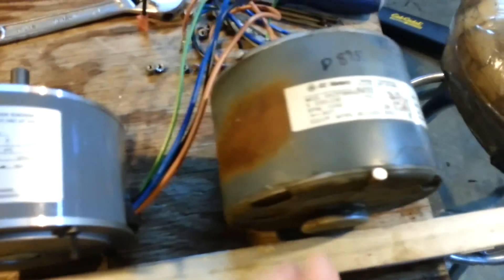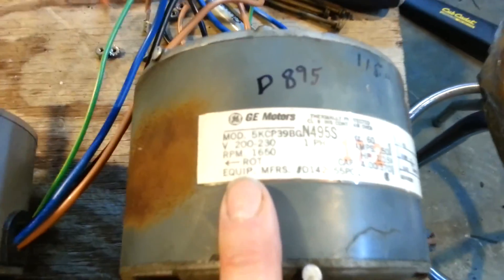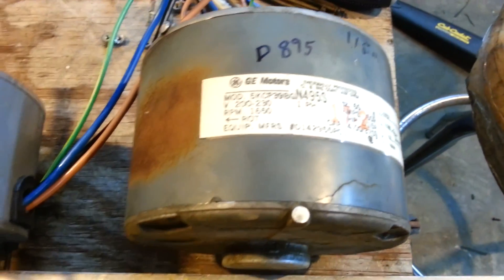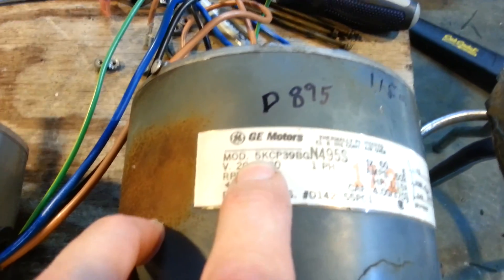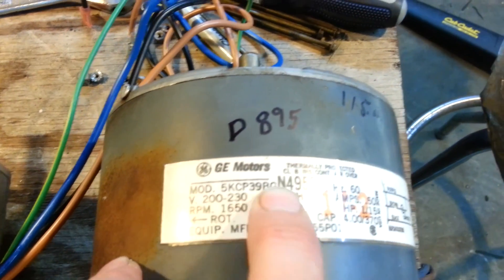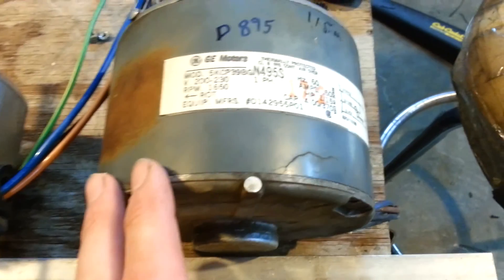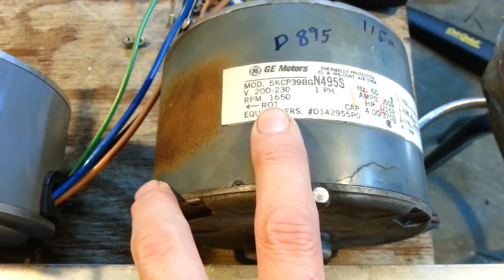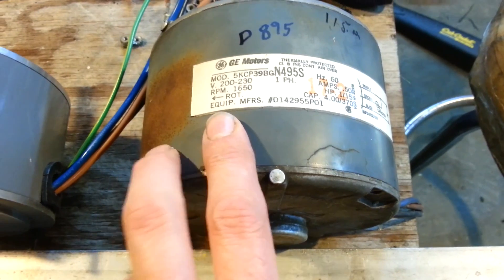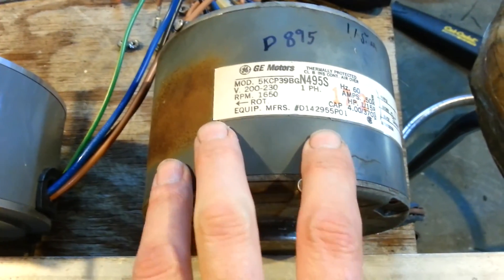One thing about this one was a little different than most I get into on my rentals. Most of them are 1075 RPM, but this particular one is out of an old Trane and its RPM is 1650. Nobody locally had it so I got on the internet. I started by googling the number off the original motor, and it was coming up like $299 for the OEM factory motor. So I started looking by specs: 220 volt motor, 1650 RPM, clockwise rotation, 1/15 horsepower, draws 0.50 amps.